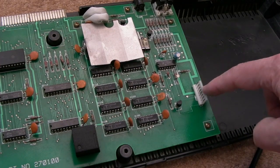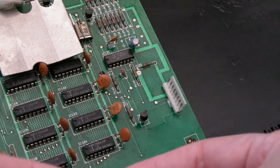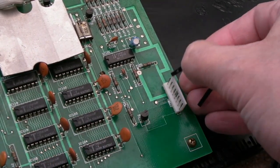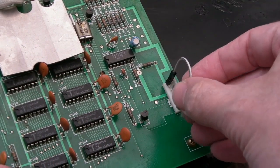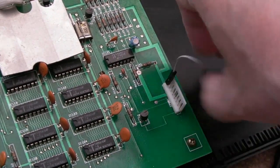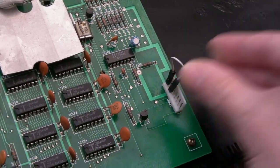So I'll just go and see if I've got a pin header I can connect. I think I have, I've got one actually, a socket to socket, DuPont to DuPont, so let me just go and find that. Yeah, here it is. This is the wire we use with the Amiga Booty McBooterson, the A2091. And we can literally just go from pin 1 to pin 3 there, and that should power it on. Let's just connect the power and video up first. Yeah, so joining pin 3 there, you can see that I switched it on. So yeah, I learned that from Yellow Belly. If you're learning that from me, you've learned it from Yellow Belly.